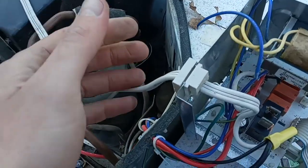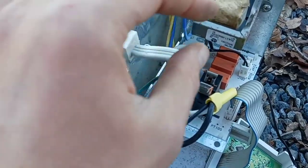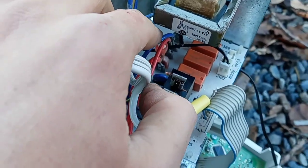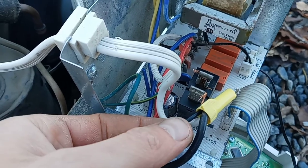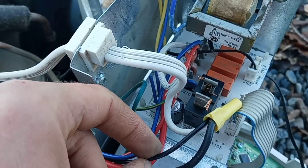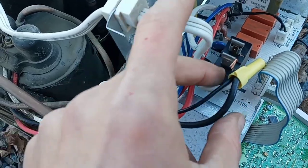Not recommended with something that's not a very old unusable AC unit, and normally you would want to read the instruction manual. But I followed the wires, and on the control board there were wires labeled medium, low, and then a black one called high to the fan, which I followed to the fan. I cut the wire and attached it into the power inlet supply — there's the one going to the fan, running on high. I took the compressor wire that was labeled 'compressor' and hardwired it into the power.